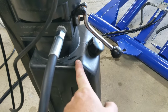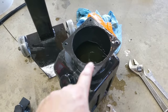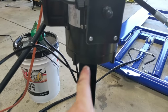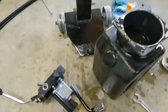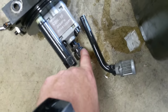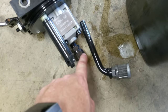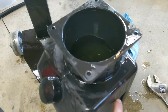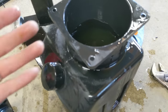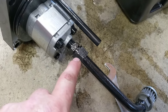So four bolts takes the tank off and the pump actually sits on top, hanging from this motor up here. What I found was this piece, which is supposed to be coupled right here, was actually laying in the bottom of the tank. So we were only picking up fluid at a high point — probably just a little bit under the fluid level — and once the machine would pick up a little bit it started sucking air, which we could hear, and that's why it couldn't pick up. That was literally just a compression-style fitting.